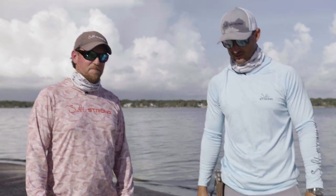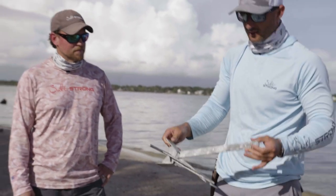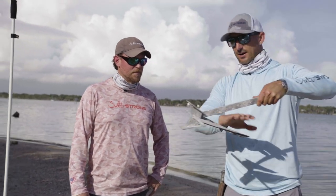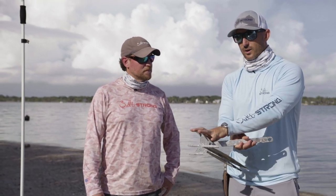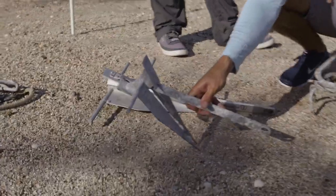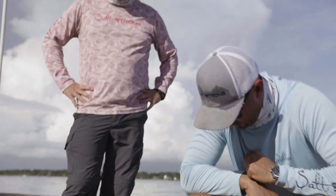Moving into negative territory — this smaller West Marine fluke anchor is built very well, but it's just too small. Maybe okay for a little john boat. When anchoring in sand or gravel, the particles are large relative to the size of this anchor, so it can't set properly. It would just roll over and drag, never getting set. Size does matter with fluke anchors — make sure you're using an appropriately sized anchor for your boat.